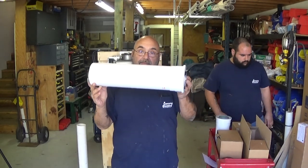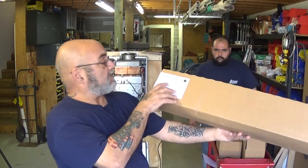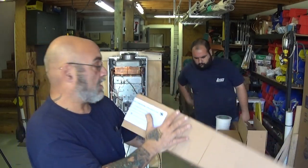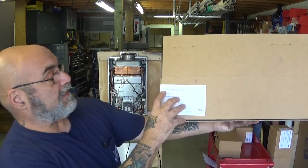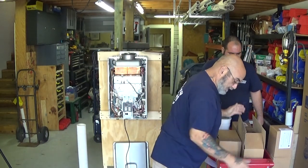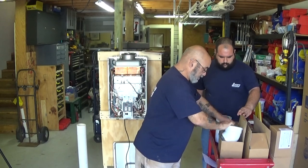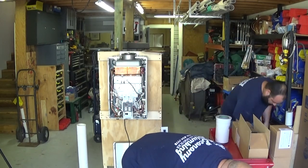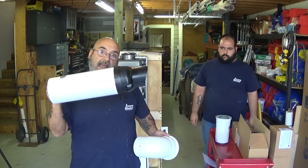Pipe sizes for both condensing and non-condensing: you're going to have a 10-inch, a 19-inch, and a 39-inch. The box for condensing models says 'for condensing appliances only.' The other box says nothing — it just says '19.5 vent pipe extension.' Ubbink sells single elbows separately, and they sell a box of 45s where you get two 45-degree elbows in the box.